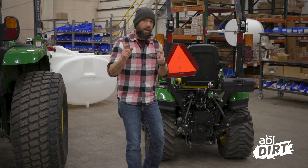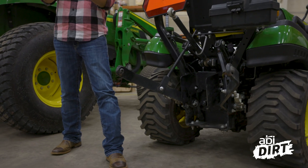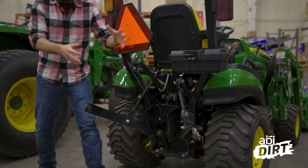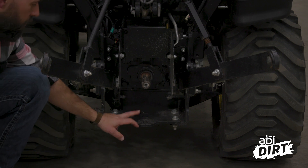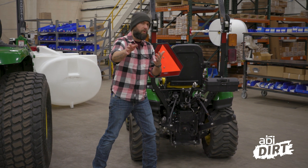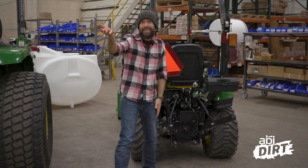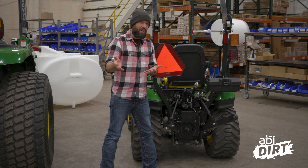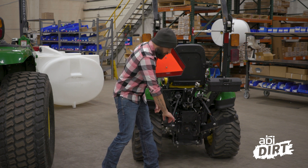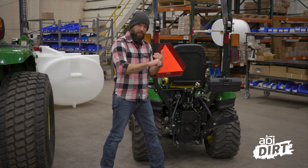That's the power sources. Let's talk next about hitch types. We're going to stay on this John Deere 1 Series because it's very prominent here. When it comes to hitch types and connection types on your tractor, you're looking at three-point — which has three points of contact — and tow-behind hitch options right down there. This is a great example of a subcompact setup because this is considered a Category 1. If you're not familiar with three-point categories, a website I love is TractorData.com — no affiliation — they've got great info on tractors and the measurements of pin sizes, top and bottom locations on three-point, and the spacing, to help you understand the categories.